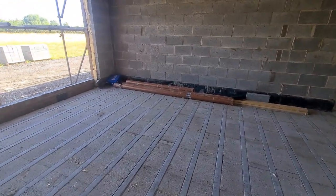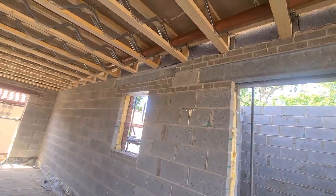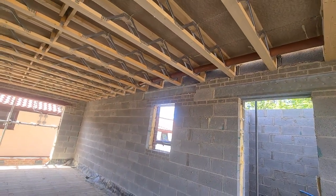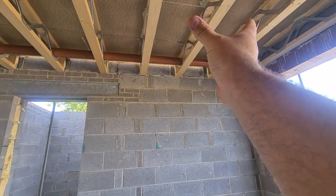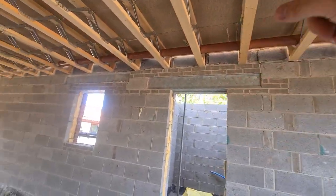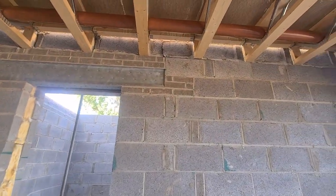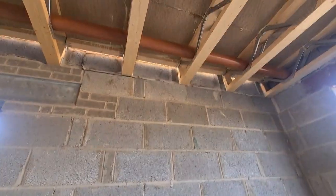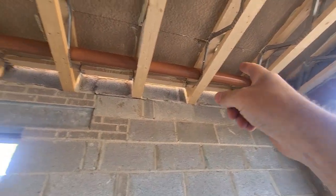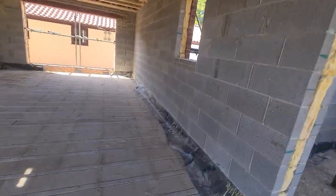This will be LPG because it's out on the sticks — septic tank and LPG. The builder has also installed a bit of four-inch ducting for us ready there. When I get that pushed up to that end and down there I'll have enough fall. The reason he's done that is because the toilet's going up there. You wouldn't get that in in a full length — I've had to put numerous sockets in. So before he's built the wall, see if he can slot that in. Just thinking forward.